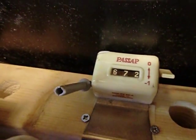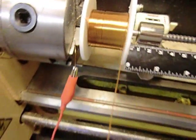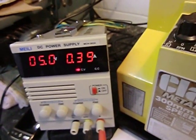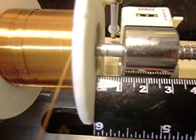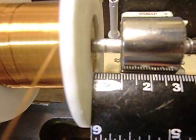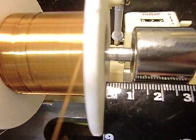Here we are at 672 turns now. It's gone a little bit fluffy in the middle, but still better than the copper wire manufacturers. Putting 5 volts on it, it's at about 390 milliamps, so we've got 12.82 ohms. Applying the 5 volts across there, it goes to just a centimetre — 10 millimetres. So just half as many windings again has increased the effect double.